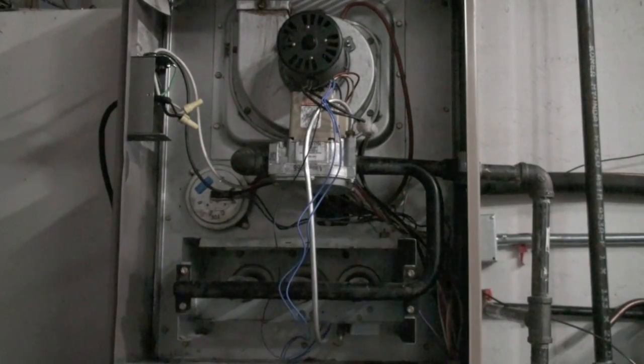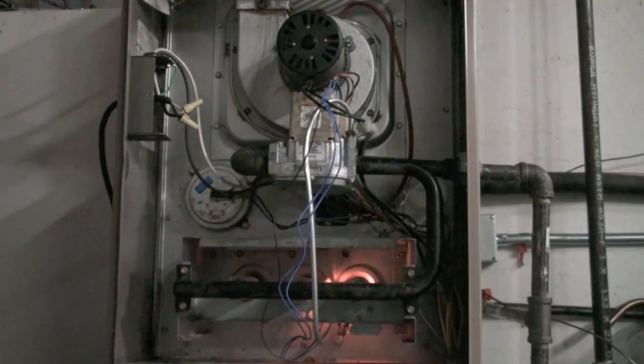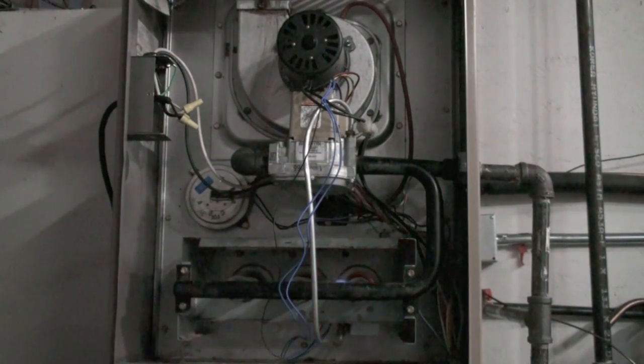What we've got today is an 80% furnace with a Honeywell smart valve — that's the silver thing in the center there. The hot surface igniter, which is a very small little yellow glow in there, is going to light the pilot. And as soon as it lights the pilot, the pilot electronically proves the flame. The main gas comes on as it has now.